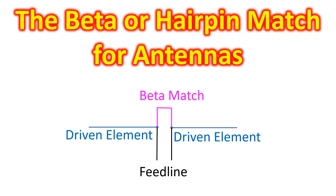I have been hearing of gamma match ever since I attempted home brewing a VHF Yagi initially and a UHF Yagi subsequently. Gamma match is meant to match the lowered impedance of a multi-element Yagi compared to a dipole, with a 50 ohm feed line running to a radio which also has a 50 ohm impedance.